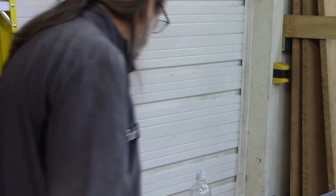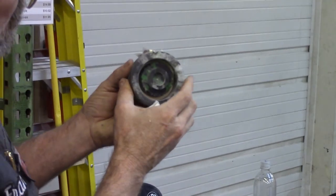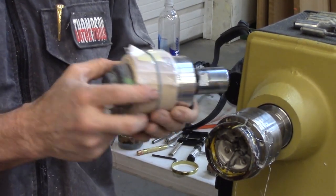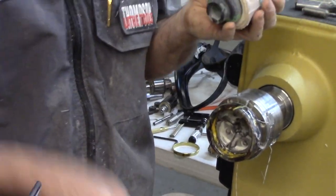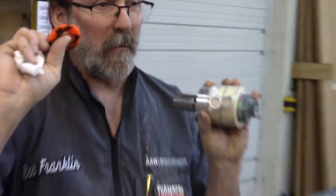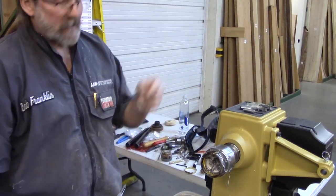The other way to do it is, I just bought this and I haven't done one yet because I just bought it, is this is essentially what we just did. So there's our bracelet. Here's the cores that this fits already. I'm ready to part it off. Once I part this off, this is Ruth Niles' off-center chuck. So I can basically unscrew it here and offset it to one of these holes, put it in hole number 3 and drill it, with the same thing that I did the other way here. So this is a more professional way to do it, an off-center chuck. That runs about $80. Yeah, I think that's what Ed said they paid.